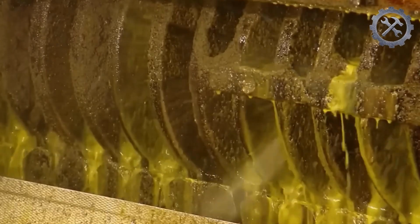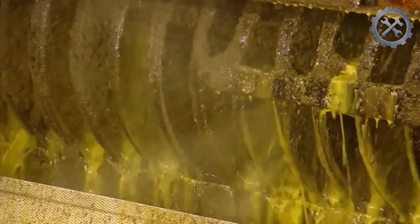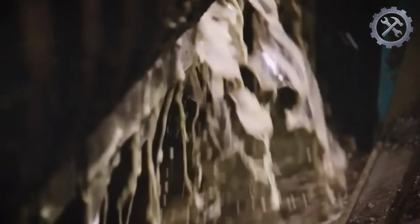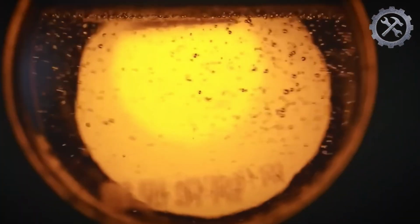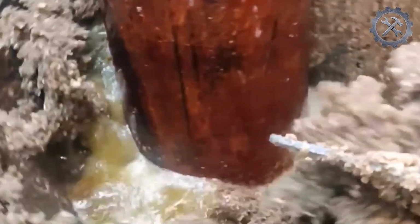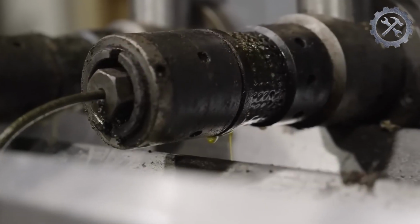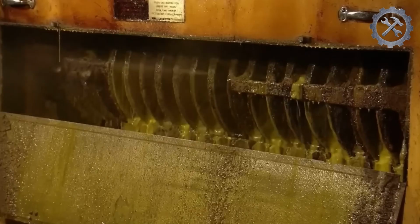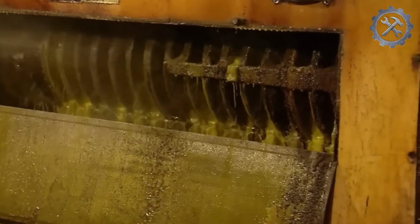At this stage, the roasted sunflower kernels are introduced into a series of mechanical presses. The internal temperature is maintained below 40 degrees Celsius. The presses apply pressure to the kernels to squeeze out the oil. The press operator must monitor and adjust the speed, pressure, and temperature. Keeping a press cool is not an easy task due to the heat generated by the seeds when crushed. At this moment, it is crucial to control the temperature.